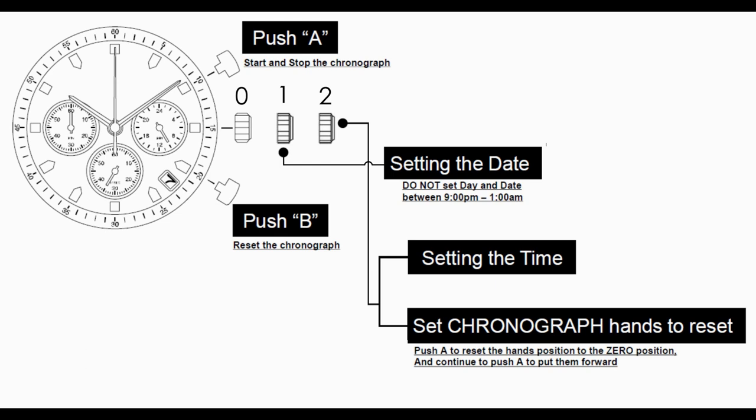The OS20 is a typical three-hand caliber with date of month at the 4:30 location and a sub-second at the 6 o'clock location. Chronograph timer utilizes the large second hand with a 60-minute counter at the 9 o'clock location. The most prominent feature of the watch is the presence of the 24-hour sub-dial indicator at the 3 o'clock location, which is directly tied to the current watch time.